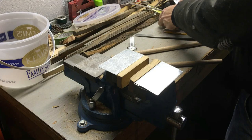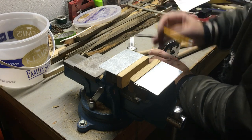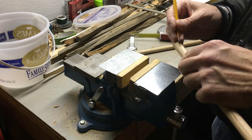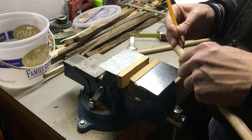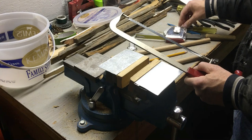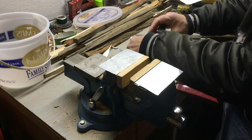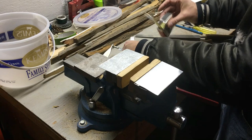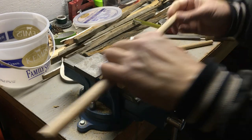On the other end, I'm going to measure half an inch — this will be the stick tip. I want to draw a line all the way around. Then I want to cut in with the hacksaw three-sixteenths of an inch, so I'm going to measure from the teeth up three-sixteenths and put a piece of tape on there so I know how far to cut.